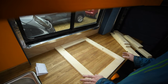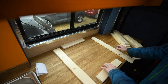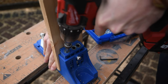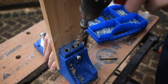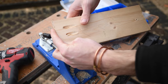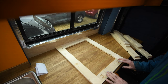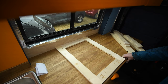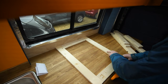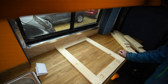To go with the theme of the cabinets above and to make it last visually longer and look better in the long term, I've just bevelled the edges with the router. For assembly I've used my pocket hole jig to put pocket holes in, and basically I'm going to clamp, screw and glue them together. I'll be careful with the pocket holes so I don't split the wood, then I'm going to route out a rebate all the way along and glue the 5mm panel in.